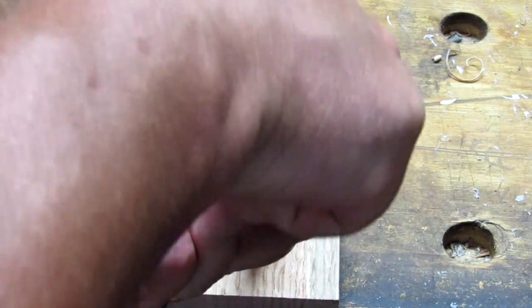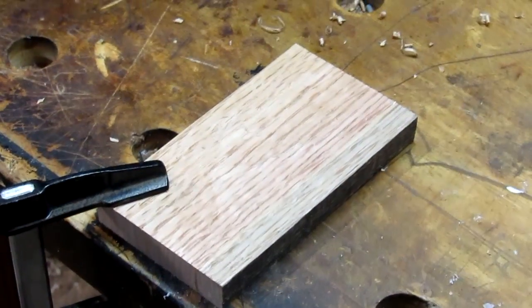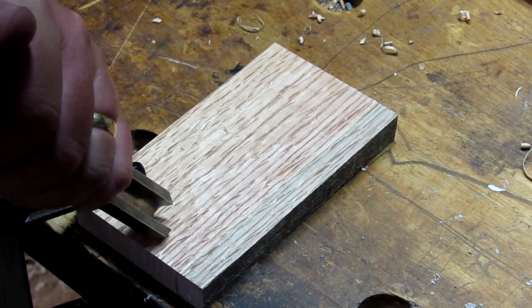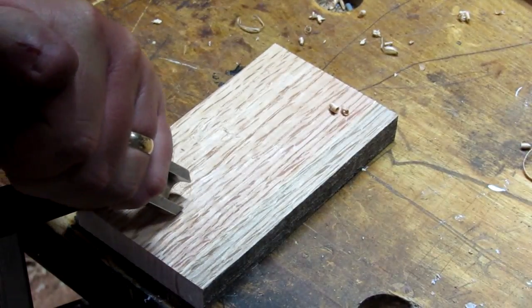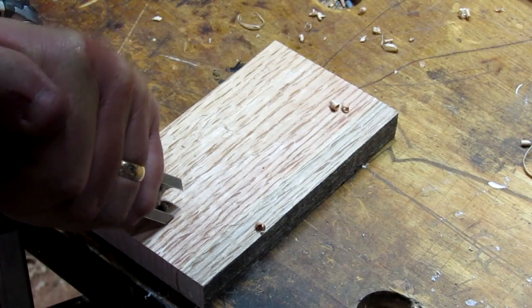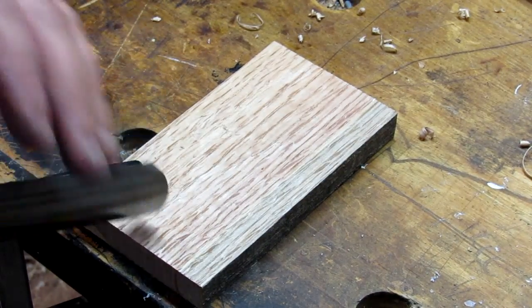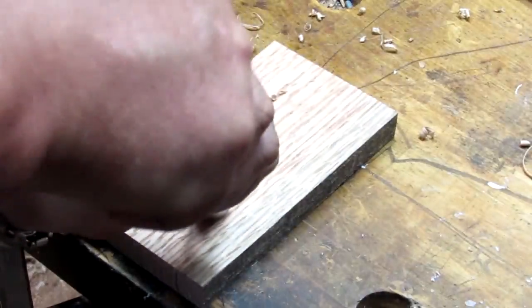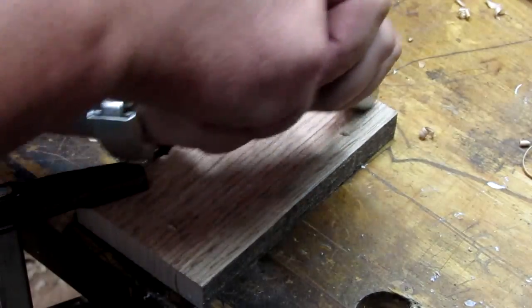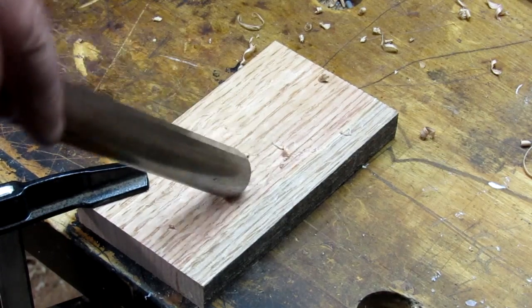Of course, you've got to know what the bevel angle is too when you go to do that. But you can see right there, this thing is sharp. Let's see if I can get on this side where I can actually see a little bit better. I'm standing almost straight up, trying to find the bevel without arcing it over. I'm getting a little better with it. But it will cut very well if I could keep from turning down like that and pulling it back up out. This thing works really good. Well, you see that shaving. And this is just, you know, with my hands. Just like that. Very, very sharp tool.